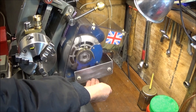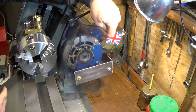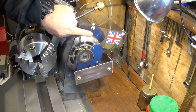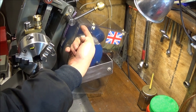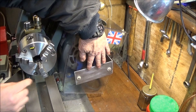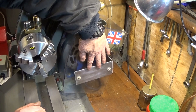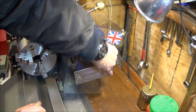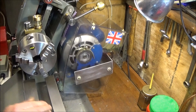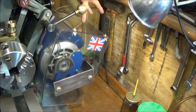With the aluminium piece bolted on the underside, I got another A4 piece of polycarbonate and shaped a curve to meet the front piece on a disc sander, getting a nice fit all the way down with hardly any gap at all. I then held it onto the aluminium, drilled two holes for 4BA taps, took it off, tapped those holes, used a plastic washer under the 4BA brass screws, and screwed it on. To finish off I cut the last A4 piece of polycarbonate down to size.